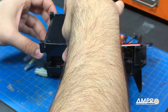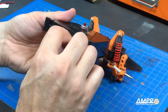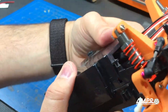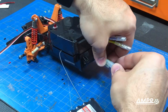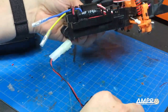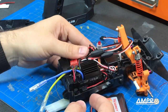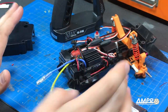The thing we'll do is just install the enclosure. I don't know if I'm going to screw it down because it may have to come off again, but let's just make sure this all still fits in there. Despite the quantity of stuff in here, we should get a good seal. It's fighting me a little bit back here because these wires are much thicker, but it is absolutely closing. I want to test out the 9.6 volt battery — I'm pretty sure it's charged, so we'll just plug that in. There is a selection here for LiPo or nickel metal hydride, and I want to make sure it's set to nickel metal hydride — and yes, this is NiMH, good. If it's set to LiPo, I suspect with this much voltage it will assume the LiPo battery is dying. The car, as far as it knows, is running on a higher-voltage nickel metal hydride battery. This means I can use this 9.6 volt pack.